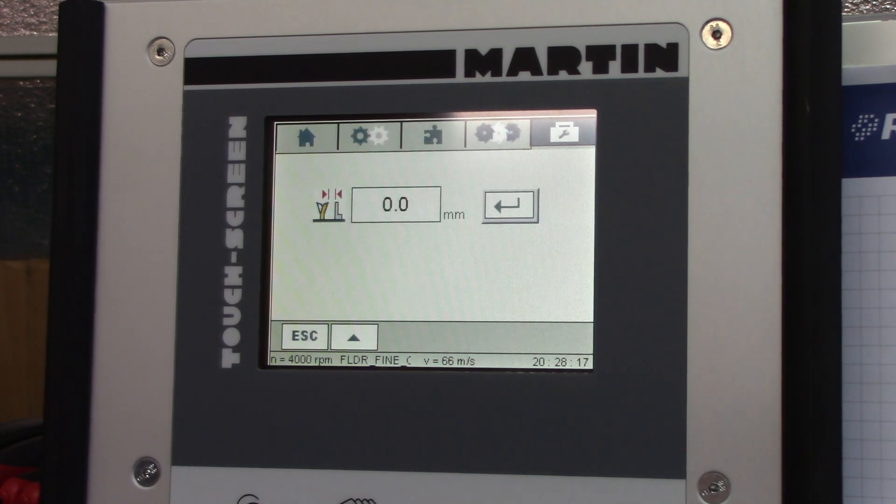On this saw, if I move the fence with the saw power down, it will lose its setting and I'll have to recalibrate it — sometimes that happens. So that's a brief overview of controls, digital controls in particular. Is it necessary? No, it's not, and it does have a downside. They could put your machine down if they fail. About five years ago I had a failure of my touch screen — it just would not accept input. The computer display worked fine, but it didn't do any good if you couldn't put parameters in to tilt the blade or raise and lower it. It took about five weeks to get a replacement computer. I did install it myself — it's not hard — but there is a downside and a cost when they do fail.